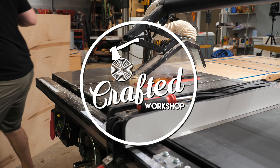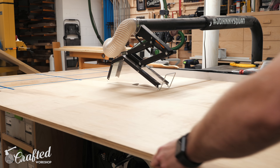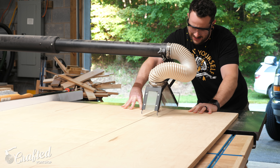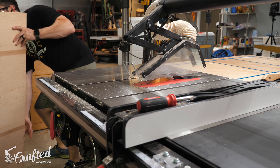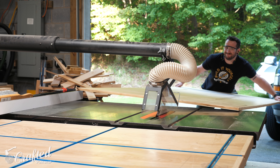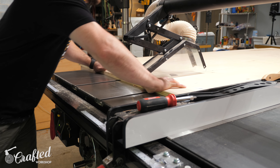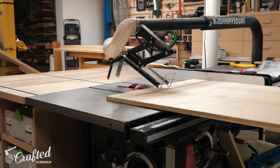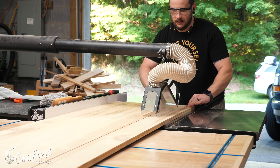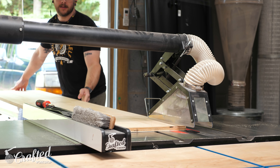This project is basically just a whole bunch of plywood, so I first started by breaking down the sheets into their individual pieces. The Murphy bed hardware is a kit from Rockler, and they have super detailed instructions, including a cut list for all the pieces you'll need. I'll also upload the SketchUp model I created with all the pieces laid out. To build this queen size Murphy bed, I used five sheets of three-quarter inch Purebond maple plywood, but I have a bunch left over — I'm going to use those leftover pieces to build a flip-top tool stand in an upcoming video.